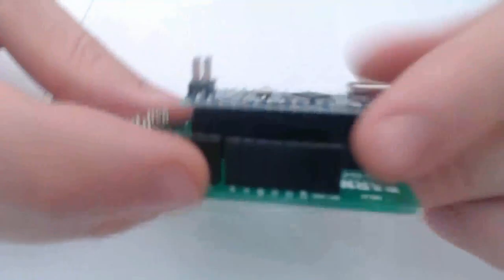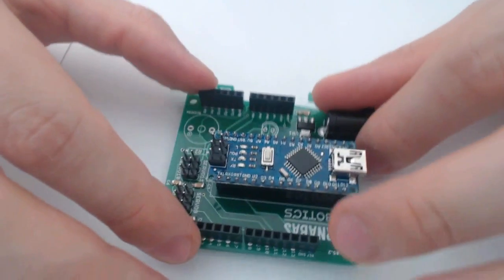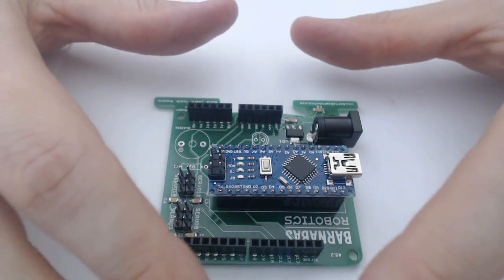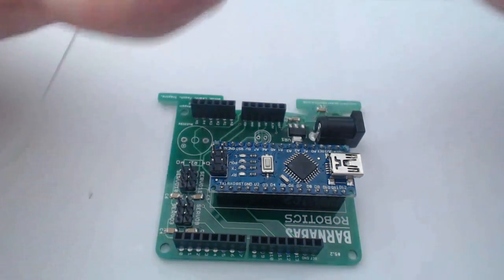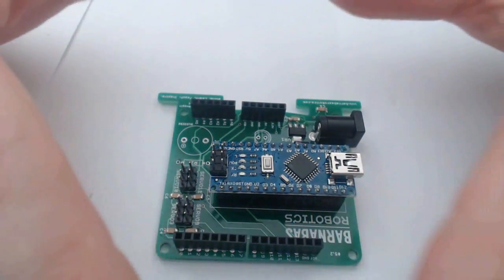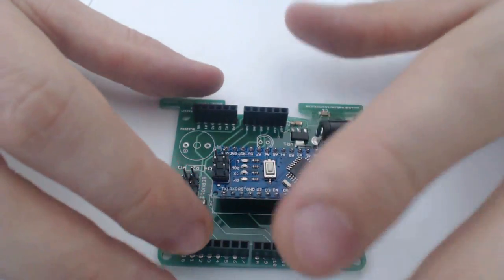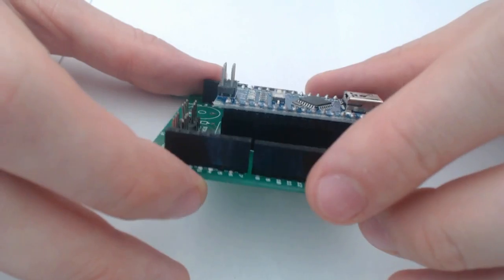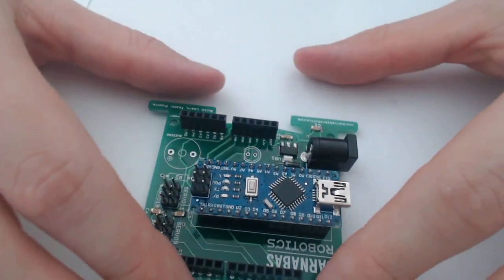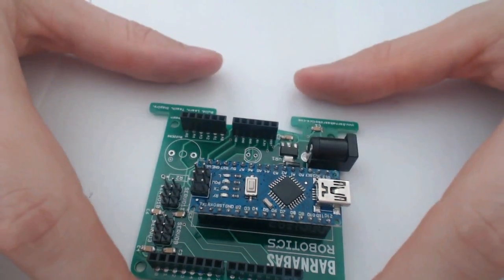Other than that, just remember to be safe. Soldering irons are dangerous. I've burned myself numerous times using them. Nothing too bad, luckily, but it's recommended that you solder in a well-ventilated area because it will produce fumes. Also use eye protection, wear some goggles, because easily the worst mishap you can have with a soldering iron is burning your eyeballs. Not pleasant. So just keep that in mind. If you end up with a couple second-degree burns on your hands, you know, you're one of us now.